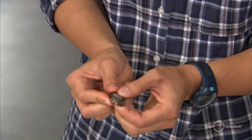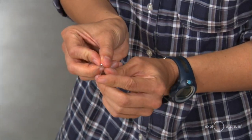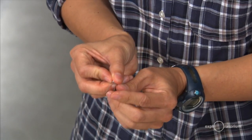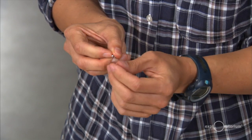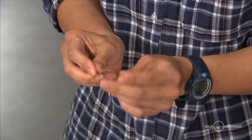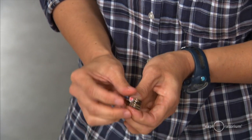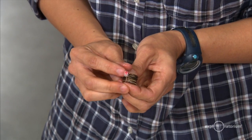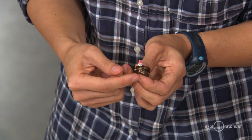With this battery, I'm going to power my LED. LEDs have legs that are two different lengths, and this is important because they only work in one direction. I'm going to take the slightly longer leg and make sure that side goes to my intact penny. You can see that my LED lights up when I have the long terminal to the intact penny and the short terminal to the bottom.